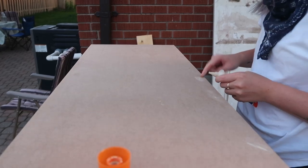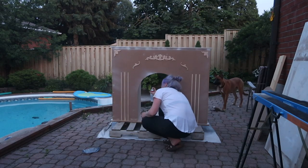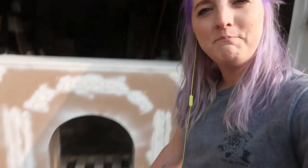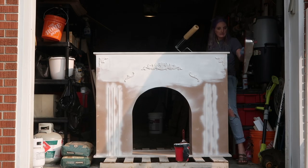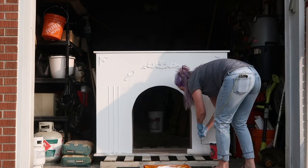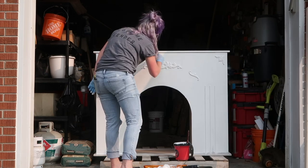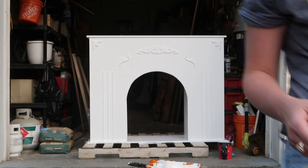It was starting to get dark, so as a last step I filled in all my nail holes with wood fill and sprayed all the MDF exposed edges with a sealant to make sure it was ready for painting the next day. It was the last day and you could see the finish line. To paint this, I'd planned to use a paintbrush, but it was so much more work than anticipated. So I found a roller to cover the majority of the surface, then used my paintbrush to get into the nooks and crannies of the ornate pieces and corners. I did about three coats of paint using a white paint-and-primer-in-one to make sure it was nicely sealed. And there we had it — our full faux fireplace.